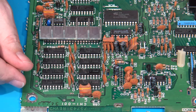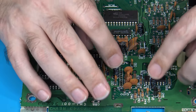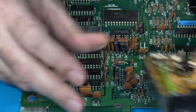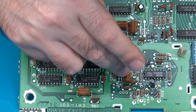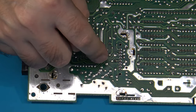So, all right. Let me go ahead and replace the ones on the board here first. Now, what I would recommend when you go to replace these, if you don't want to mess with this RF modulator box again, like I just did, then what I would highly advise is that when you install the replacements on this, install them on the bottom of the main board itself.